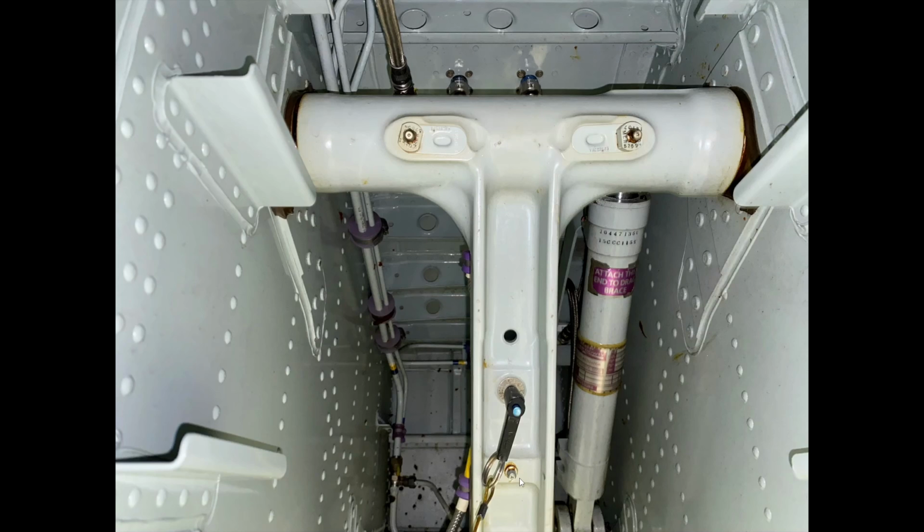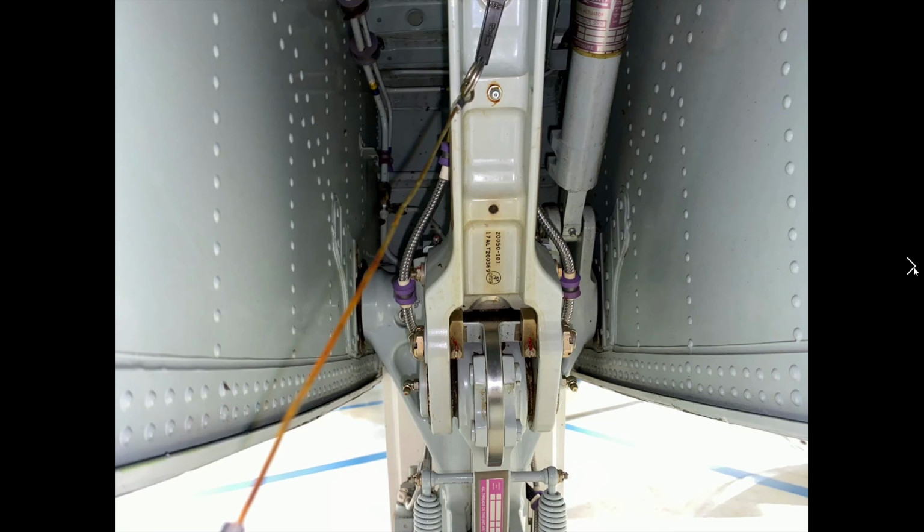and we'll push the switch inside, which is the nose gear bay door actuator, and that'll open up the doors hydraulically. That will allow us to put the pin in here, and that will then secure the nose for ground handling. More mechanisms to look at here.